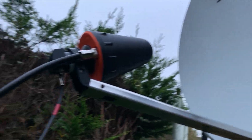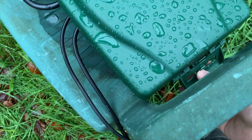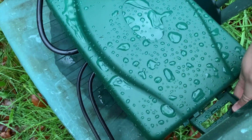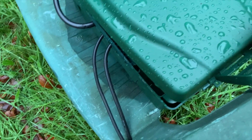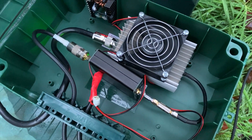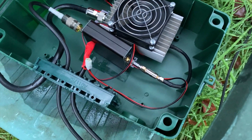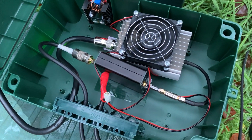This connects to the output side of the SGLabs V3 amplifier. Inside this waterproof box, I have a 13.8-volt feed coming from a power supply in the shack, and a 50-ohm Mini-8 coax coming from the HS2 radio, also in the shack. The coax plugs directly into the DX Patrol up-converter, and the output goes through a 2.4 GHz filter, which also helps attenuate the up-converter signal, then feeds directly to the input of the SGLabs RF amplifier.